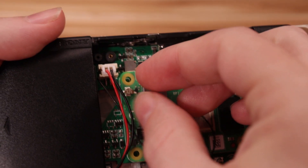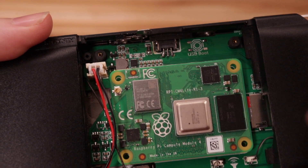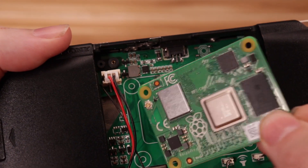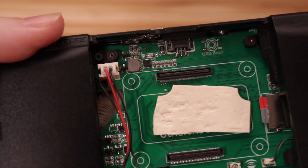The CM4 has the same antenna connector as the original PSP, so you can use the PSP's built-in antenna on the wireless CM4s. I was able to go with passive cooling on this by using a thermal pad between the CM4 and my board, and the mass is big enough to keep the temperatures under 60 degrees Celsius.